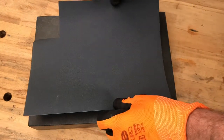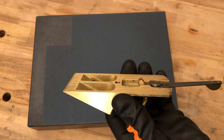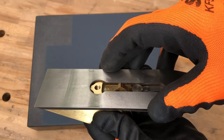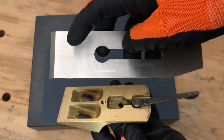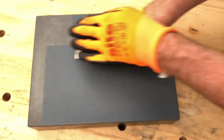Back to the surface plate for the next stage — some spray mount, then some 220 grit sandpaper. We're going to work on the upper surface of the frog. The issue is that we can't just turn the frog upper surface down onto the paper and start rubbing, because the depth adjuster yoke and the lateral adjuster button stick up and prevent us from doing that. The solution is a jig of some sort to provide clearance — and what better jig than to use the blade itself. The button of the lateral adjustment lever sits below the surface, and the yoke, being free to move, just trails along on its own. First thing to do is to smooth the surface on the blade that's going to contact the frog.